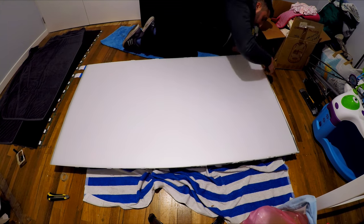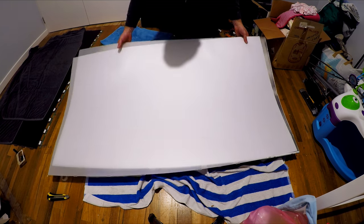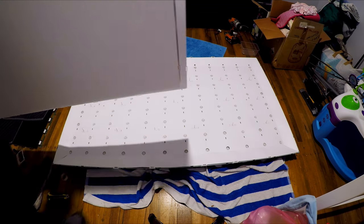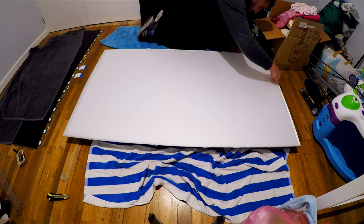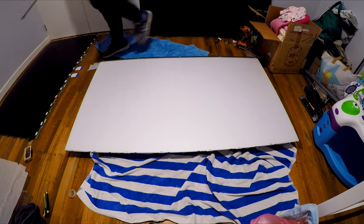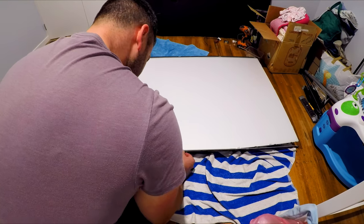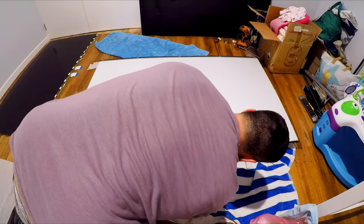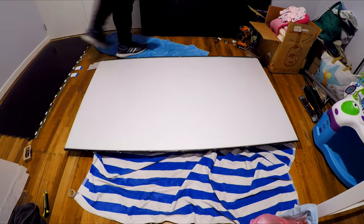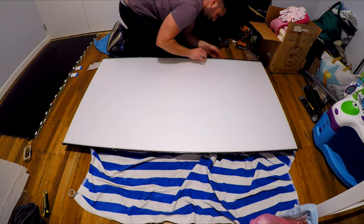You'd think putting the TV back together is an easy task, and yes, again it is. Once you put all the filters back in and all the clips back on, between the filters and the actual LED TV, you want to be very careful. There are the actual side pieces that hold in the screen. If you skip this stage and put the screen directly onto the filters, it could hit on the side brackets and cause the screen to crack. So be very careful with this.